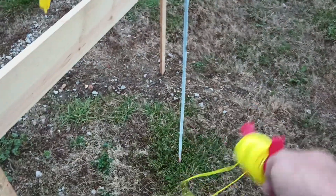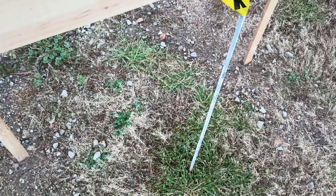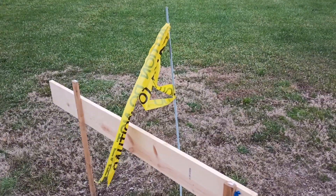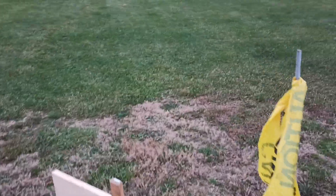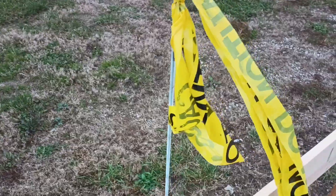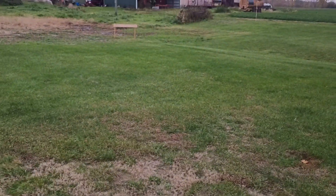When we set our post in the hole — we're going to dig a 20 to 24-inch hole with an auger off the skid loader — we drop our concrete puck down in, then compensate an inch and a half on each corner so that we can true our pole running vertical. We make sure we are square with our string on both the east and the north, and once the post is square with the string we can make sure the post is plumb.